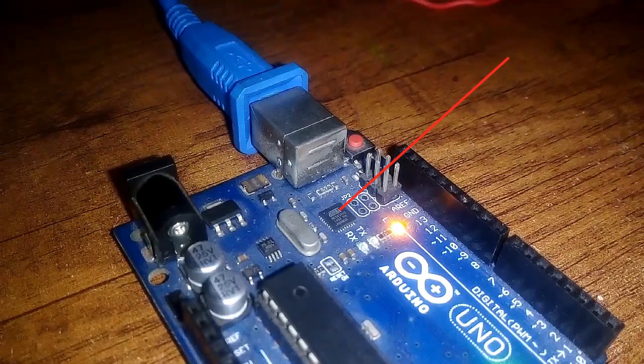How can you use our Arduino, which is a serial device, as a HID-compliant input device? HID stands for Human Interface Device. What we will be doing is — while programming the Arduino, the main code runs on the ATmega328P for Arduino Uno or Nano. To use it as a HID-compliant device, we will be coding the USB-to-serial chip on the Arduino rather than the main microcontroller.